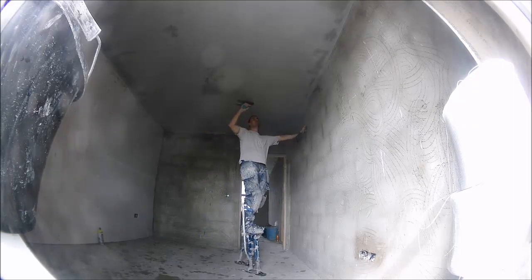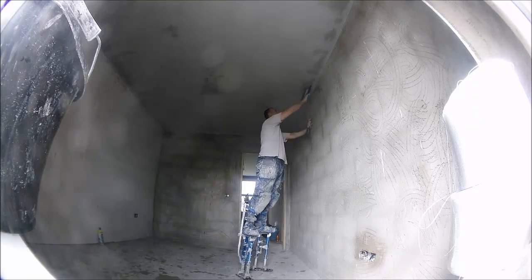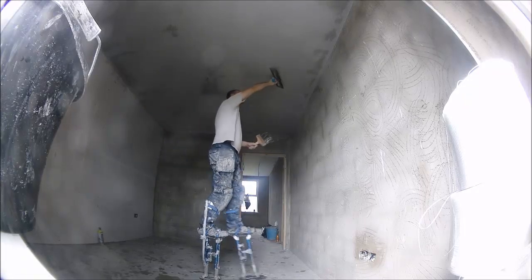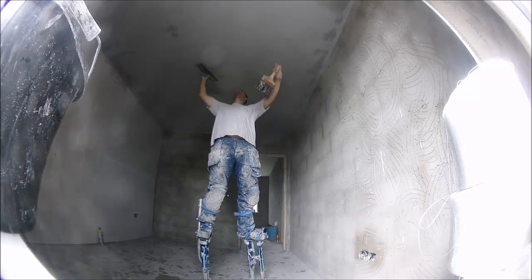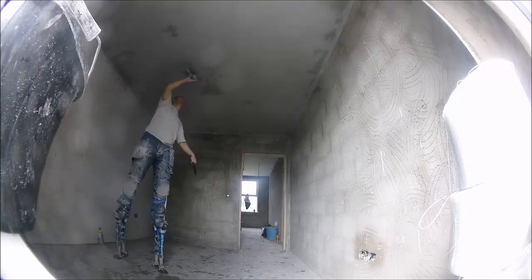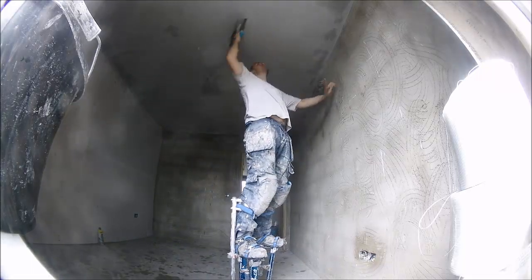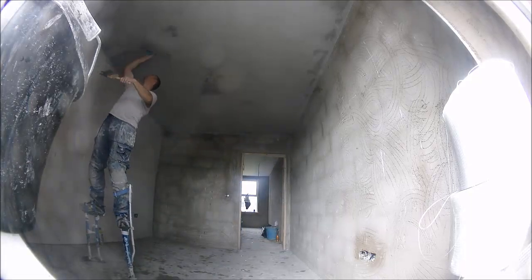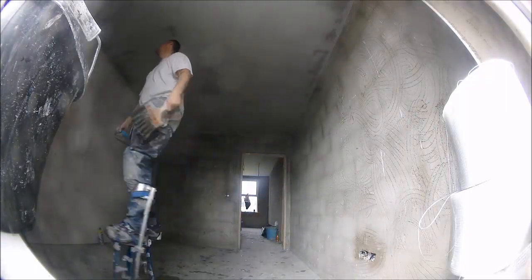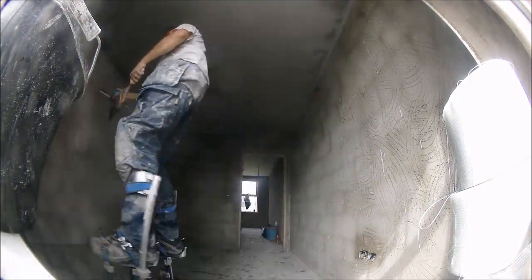Just keeping the blade clean and wet, chasing the ceiling back to the very end — this will take out any wee water marks. At this stage you must have no holes, though you can still fill slight holes before it's completely dry. You can see it's going brown — don't panic when it starts going brown, that's normal and what's supposed to happen. In about an hour's time when I finish, this whole ceiling will be completely brown. If you do need to fill holes, now is the time before it's completely brown.